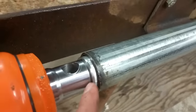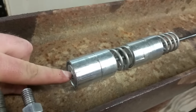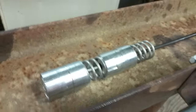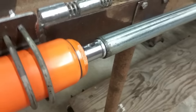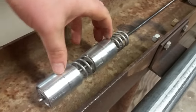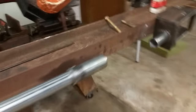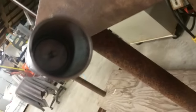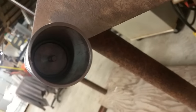On the very end right here, I have a bushing that has a blind hole in it — the hole doesn't go all the way through, it's only about halfway deep, so the rod sits right in the end of that. When the ram starts pushing, it's pushing that rod, and as all these bushings compress, it keeps everything nice and supported as it emerges out the other end. You can see the pushrod emerging from there.